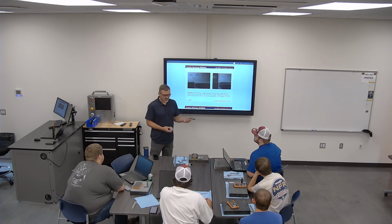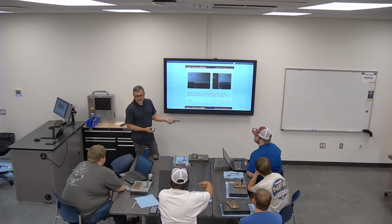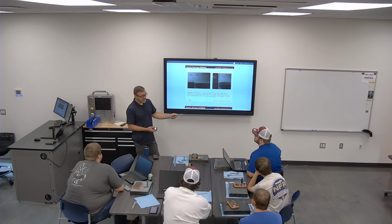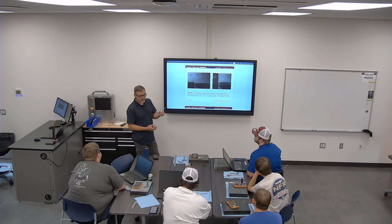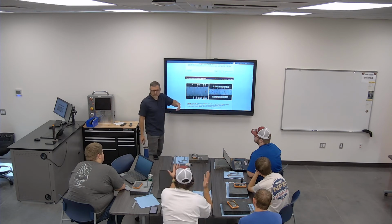A lot of times when measuring with a tape measure, you'll oftentimes move to the 1-inch mark, not the end, because the ends of those things get beat up pretty bad, so it's more accurate to measure at the 1-inch mark. I do it every day. On a scale, that should not be a factor. A scale is pretty rigid on the ends. Shouldn't have to do that. But I just do it out of habit, I guess.